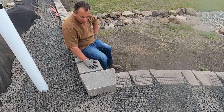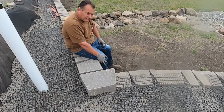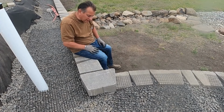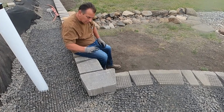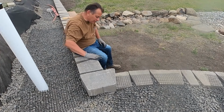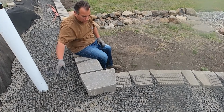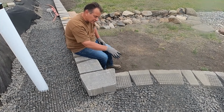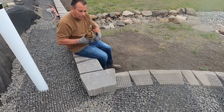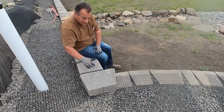Okay, I've made the turn. Now, I am trying to do the crisscross stack all the way up. I did have the last 2 courses go the same way, unfortunately just because of the way it was working. But now I'm back to the repeat this way, so I'm pulling across accordingly so that it has that kind of strength that comes with it. Of course, I have the geogrid that's going to pull it this way, and then eventually there's going to be this pull this direction, so it'll be a solid corner. You don't make the corner where it just butts in, and then that's a gap in the corner. You've got to overlay, and I've done such.